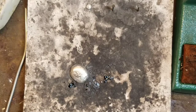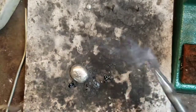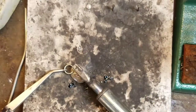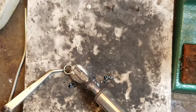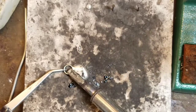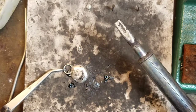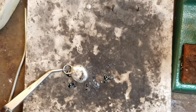Next I'm adding some flux to the jump ring. Then I'll place the jump ring on top of the solder ball and use the tip of my iron and gently tap it until it covers the jump ring. I want to embed that jump ring into the ball of solder. Once I do that I want to wait a couple of minutes — try not to move it until the piece is cool.